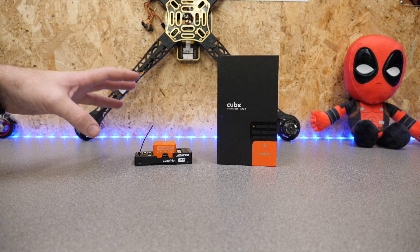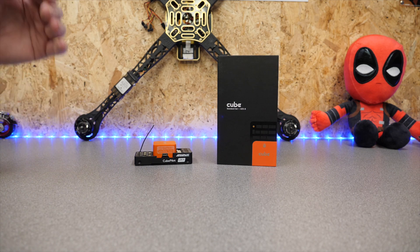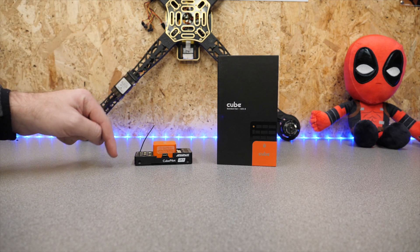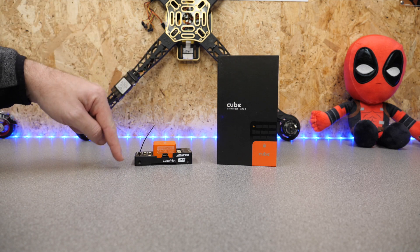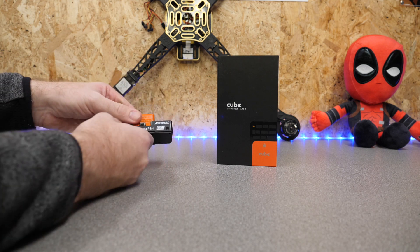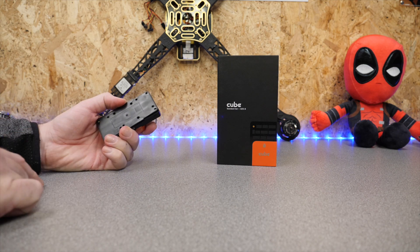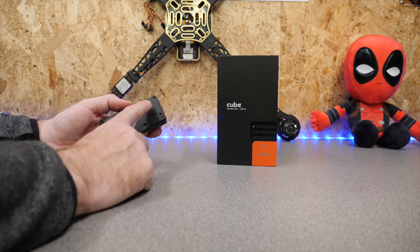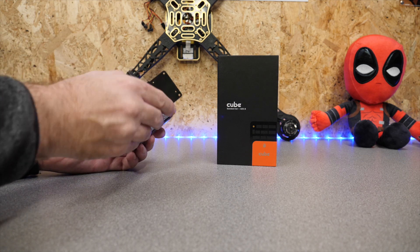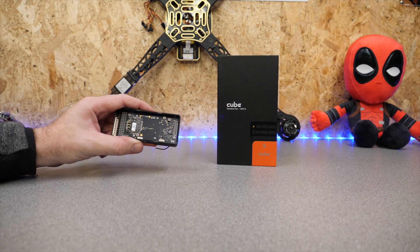There is a silk screen on the board that allows you to modify it to either solder a wire on directly or mount a UFL connector. To do that, the first thing you'll need to do is remove the four screws on each side of the autopilot — one, two, three, and four. Once you've removed those, you then have an additional four screws on the bottom to remove, and once you've done that you'll be able to remove the base plate off the board, giving you access to the inside of the carrier board.